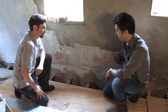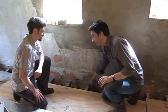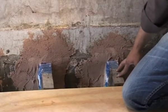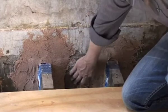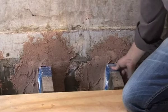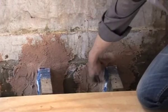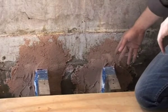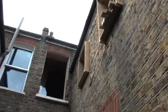In this location life's made easier in one respect because the outside of the wall is insulated, so we've not got a rot problem where these joists sit in the wall — not a lot of moisture. But we still have the air-tightness issue. So in order to achieve a good air-tightness connection between the timber joist and the plastered wall, first job was to parge the exposed brickwork — that's the brown sand and cement there — and then tape the joists with blue tape so that we could make an edge to the joist that can be stuck to. Then Contiga tape has been stuck to the blue tape and then stuck to the sand and cement, and then this pink plaster is applied over the top. That should give us a completely sound air-tightness junction at that point.